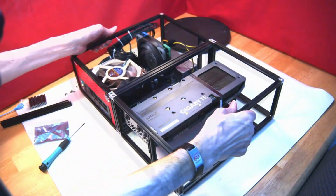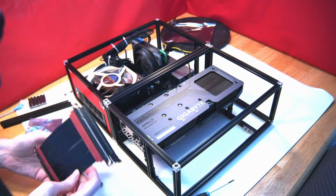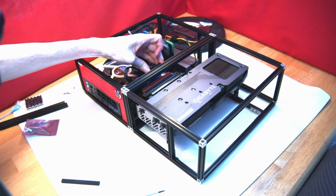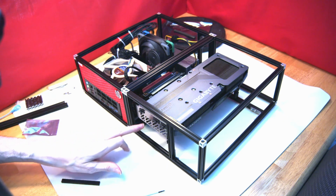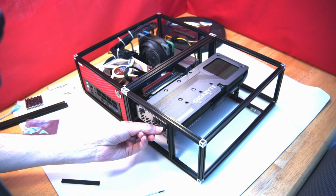We have 2 final pieces of work to do here. Firstly, to fit the PCIe riser cable between the graphics card and the motherboard. I needed a cable that wasn't too long, was also flexible and supported PCIe 5 to get the best out of the graphics card. Fitting it was a little fiddly, but it's very unlikely to become loose.